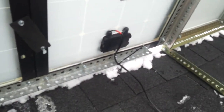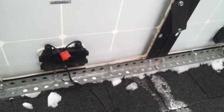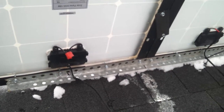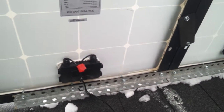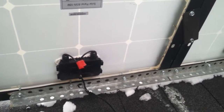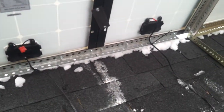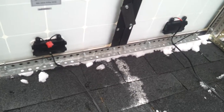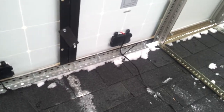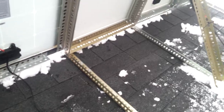The two 80 watt panels, I basically used the existing wire setups — they're set up just like the Harbor Freight ones on these panels. They're Green Power brand, I think. Those two 80s are actually the ones that are charging my battery bank. They're run in parallel, keeping it at 12 volts.